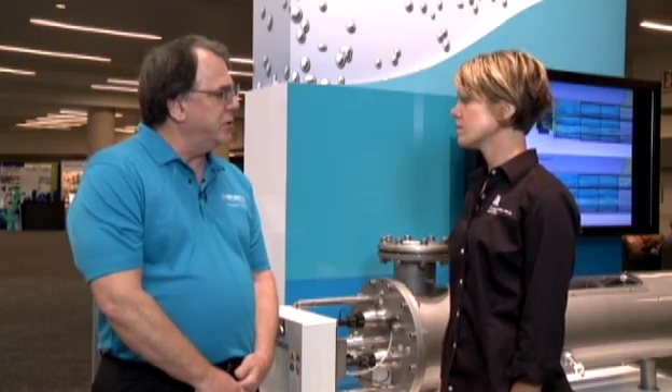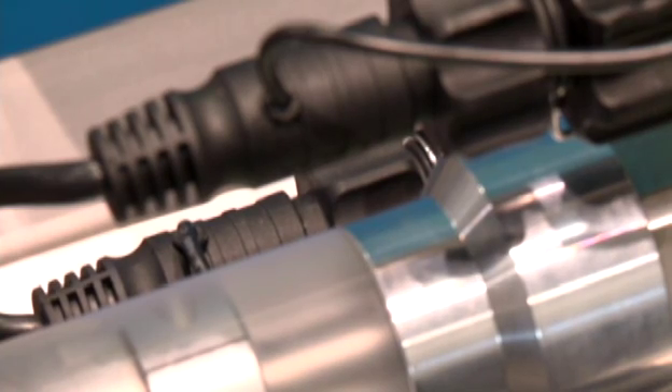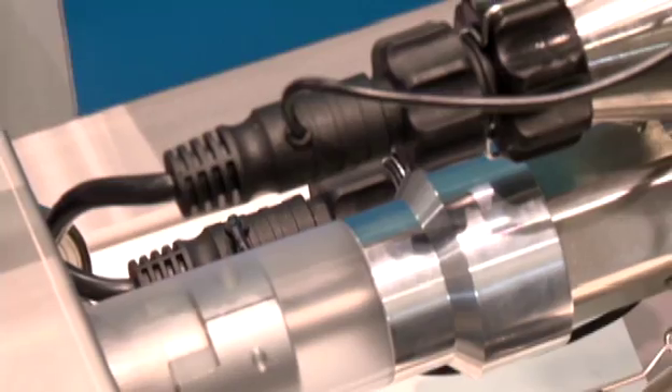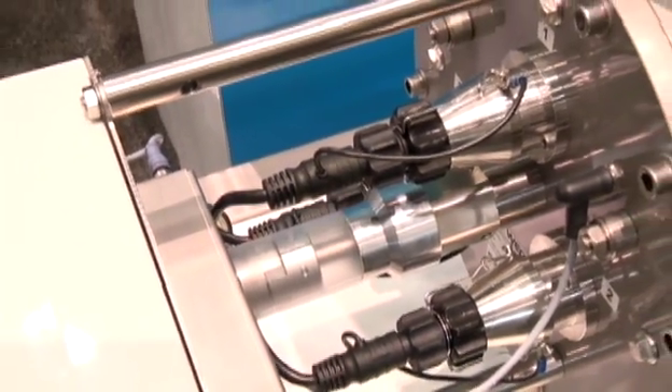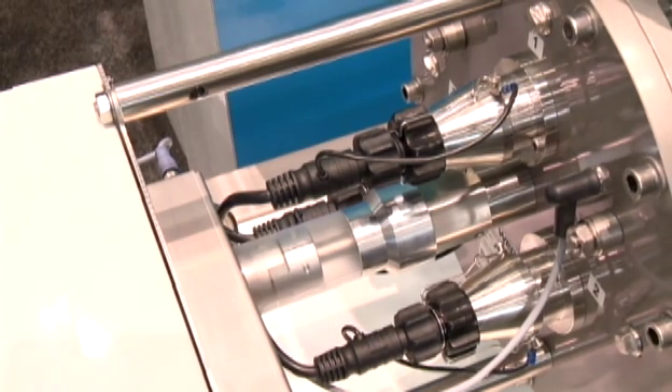Can you explain a little bit more about how the Spectron E fulfills these requirements? The Spectron E is a redesigned version from a Spectron unit that we introduced several years ago. For this unit, we have added our new eco-ray lamp and ballast technology, which is very efficient. It can add about 20% more efficiency performance to the unit — the customer can get as much as a 20% savings on his electrical costs. It lasts longer, with a 14,000 hour lamp lifetime.